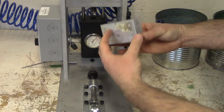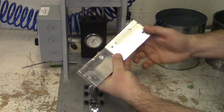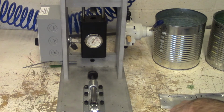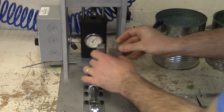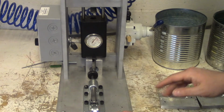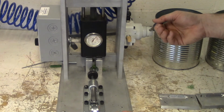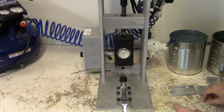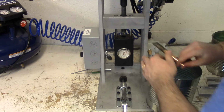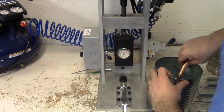Now to make a screwdriver handle, I have the mold. Again, I want to put a bit into my screwdriver handle mold. Now remember, the screwdriver handle is made out of low density polyethylene. I'm going to put this purge block underneath there, and I'm going to purge out all of the high density polyethylene. So now I want to fill this with low density polyethylene beads in the same manner. Try not to spill them all over the heating chamber.